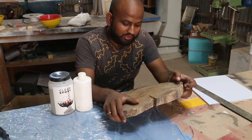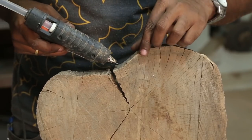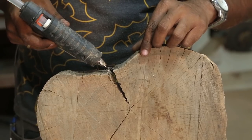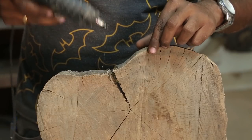Because this looks like a porous wood — I have not worked with fig before — it might suck in a lot of epoxy. I do not know how it is going to work, but I will just try bridging it like that, making some bridges first and then probably I will be able to pour over it, so that works.